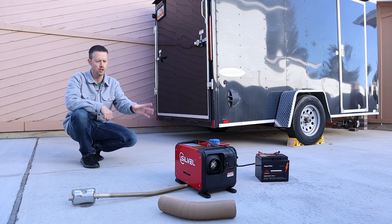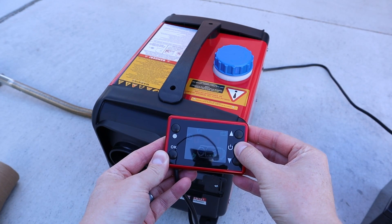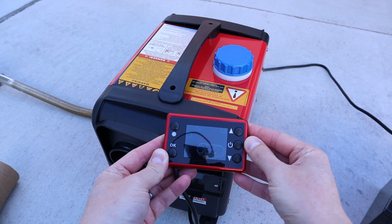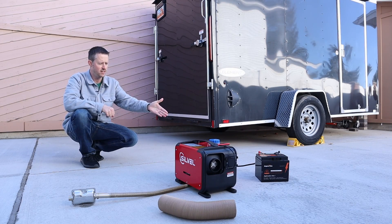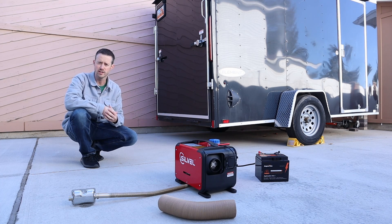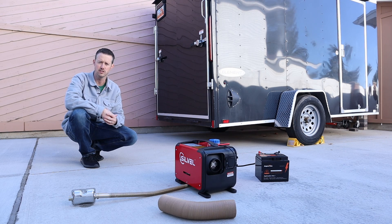I've put this back on the lowest setting so it can cool off before I turn it off. When you turn one of these off, you press and hold the power button on the display, and then it goes through a whole shutdown process. It's normal for it to keep running after you turn it off — do not disconnect the power, as it won't go through the proper shutdown process that way and you can get soot and buildup on the inside of the heat exchanger.